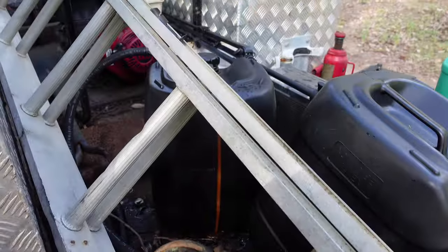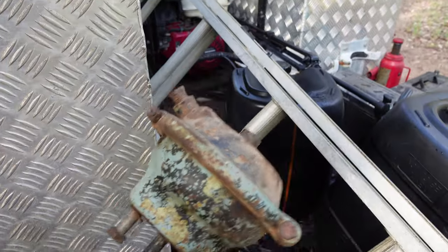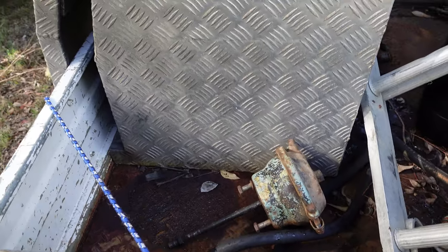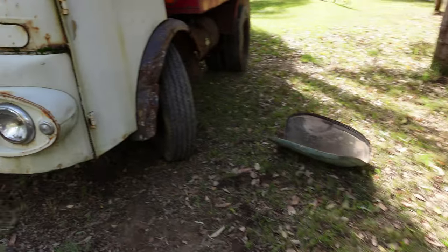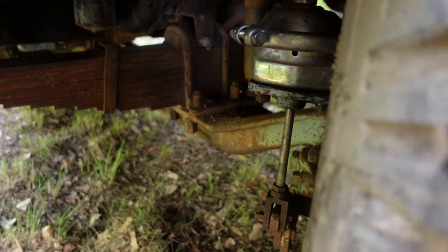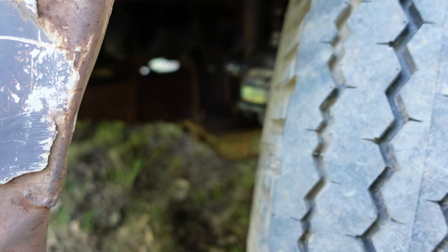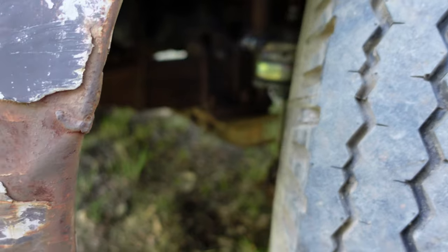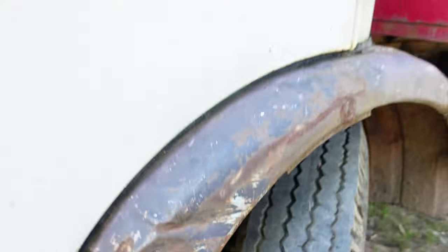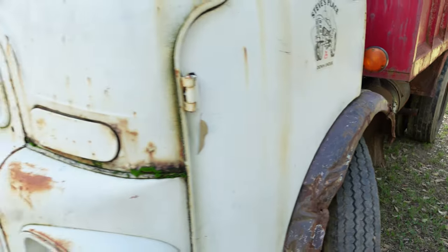Okay, so I changed the booster off camera. I was just going to change the diaphragm, but it's a little bit smaller, this one. I don't think it's got quite the travel either, so the S-cam moved a lot further than I think the booster's going to go, so that wheel must be out. I'm not going to adjust it now, but it's going to stop the air leak anyway. It'll still work, but probably not to its full potential.